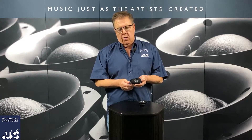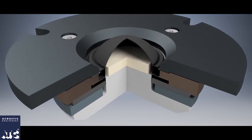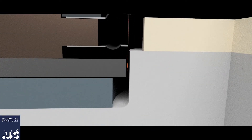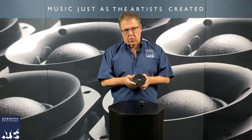This part is also designed for very low distortion. It is very much like the midrange that you saw in our midrange video, where it has two suspensions. Same thing here — there are actually two suspensions on this tweeter. And we use a very special magnet and motor assembly to get more power out of it. So this particular tweeter is sort of a miniature version of our midrange, and it has very low distortion.